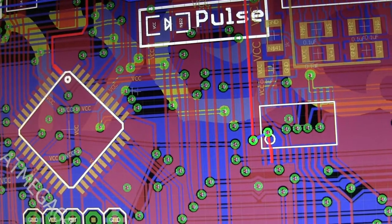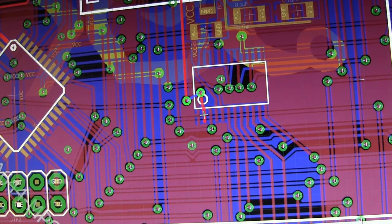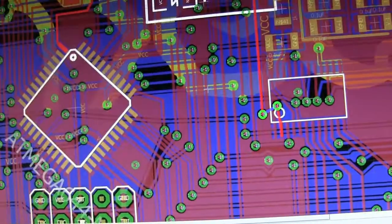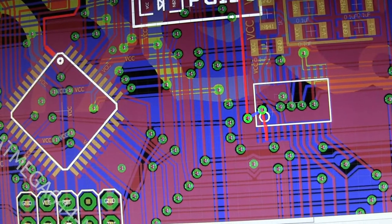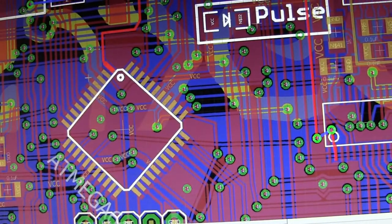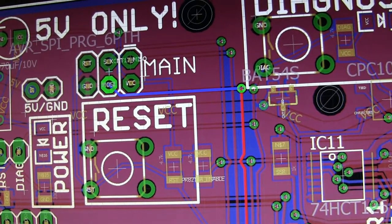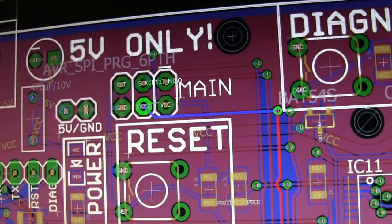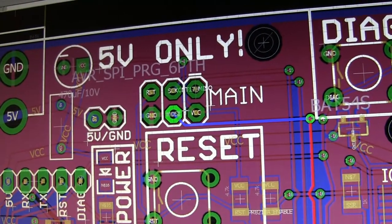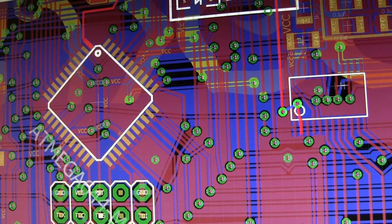it's possible. So I wish I could deduce, like eliminate what I don't think is causing the problem, but based on what I'm seeing right now, the problem could either be this LED driver causing problems, the main microcontroller being bad, or these pin headers up here being bridged. But I think it's pretty unlikely that these pin headers are bridged, because I can quickly determine that just by using a multimeter. So I'm going to go ahead and do that, but I think it's pretty unlikely. So based on process of elimination, I think the problem is going to be either this or this.